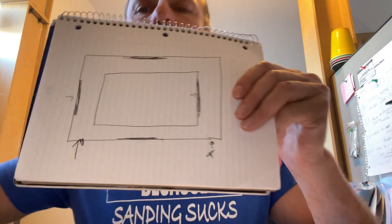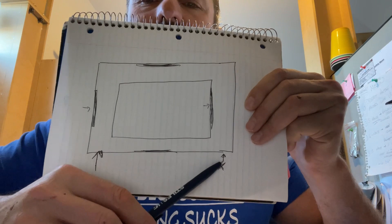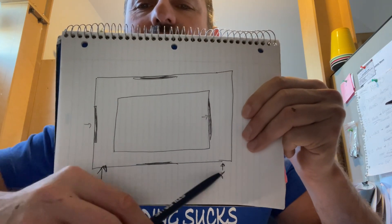Let's take a look at another scenario. Let's say you're sanding that back edge and for whatever reason it's not quite touching the edge on one side, but it's doing a pretty good job of the edge over here. So it appears as if the robot is moving on a slight angle. What I would do in that case is just slowly bring that head in and in and in until it is sanding evenly across the whole edge. And the exact same thing works on the surface of the door as well.